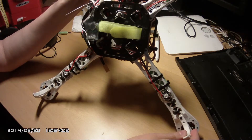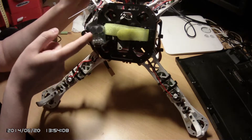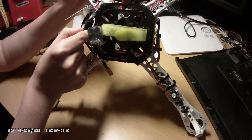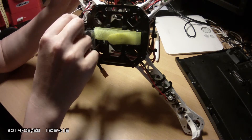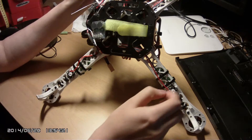One solution is to use an adjustable step-down converter, or a switching mode regulator, whichever naming you prefer. The trick is to adjust the voltage of the converter to a point where the LED is at a preferred brightness, but of course below such voltage where it becomes too hot or burns out.